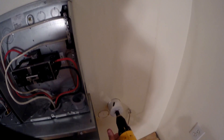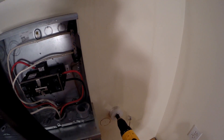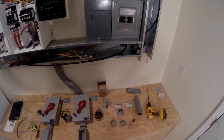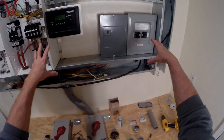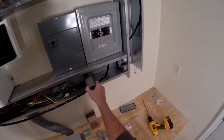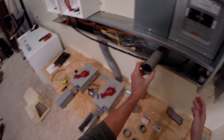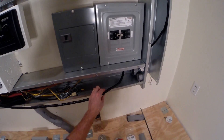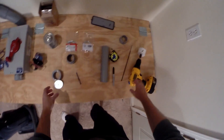New problem - right here is the fire blocking, so we're okay on this one, but the other one is going to be right in the fire blocking, so I can't go there. I've decided I'm going to go ahead and put these on the outside wall on the other side of this wall, running one here and then one at the same height about 16 inches apart. That'll give me plenty of room and it should be pretty clean and simple.